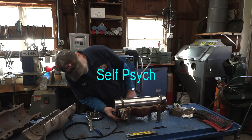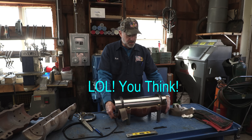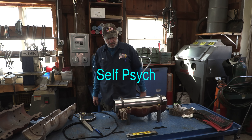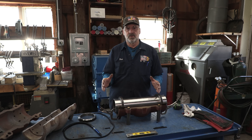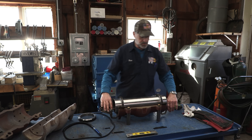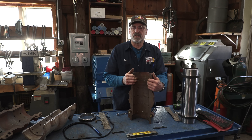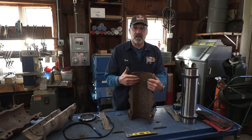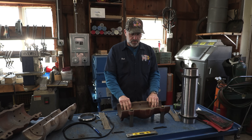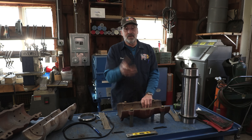How are we going to clamp this? Once this is held down in there, there's no way anything is going to leak out of here — it's a pretty simple pour, really. I found two clamps that will allow me to reach on this little lip down here, inside the pipe on both sides, and hold this in here very secure. The difference between this housing shrinking and the Babbitt shrinking — you're going to have issues of separation. Those are the things you want to overcome when pouring a Babbitt bearing; you want the shell to adhere to the housing. That's number one — we get good pours, then we can go machine a bearing.